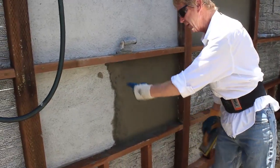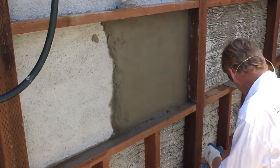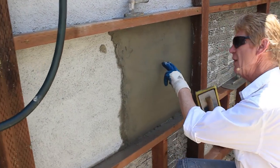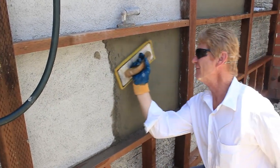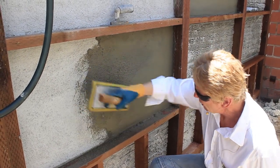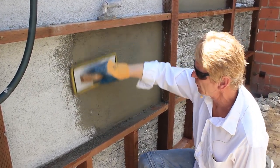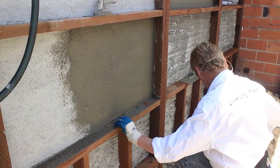Okay, so you got a cold joint. You don't want a cold joint, guys. What you want to do is go from corner to corner. But since I've been asked this question so often, I'll tag this video, cold joint. What's a cold joint? That's a cold joint. And so what we're going to do is I'm going to take the new stucco and bring it into the existing stucco and feather it in. I'm pretty good at feathering in, good as the next guy. But still, a cold joint, if you go to color coat it, which a lot of newer homes get. A lot of new homes get color coat, maintenance-free, integrated color finishes. The older homes, they're usually painted.